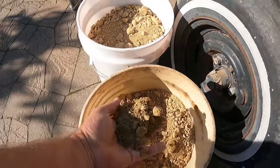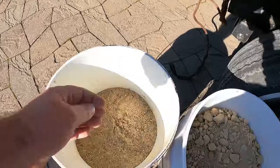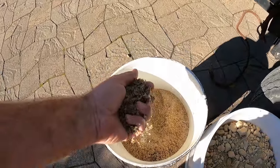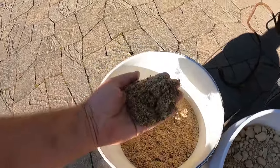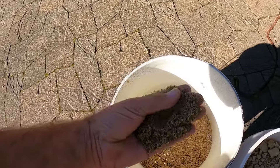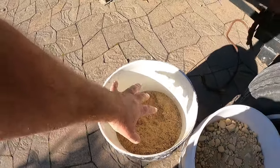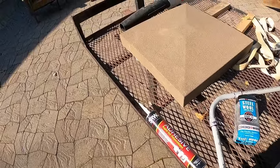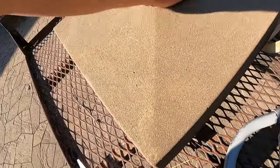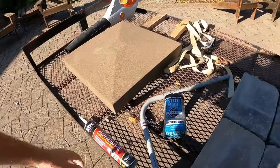In the pails I have some crushed rock — that's going to be our base. We're going to put in about three inches, and I'll be using a little bit of sand — some very simple wash sand. I'll point out that it's a different size of sand, so using mortar sand, masonry sand, or playground sand is not advisable. We want those different sizes of aggregates in there. For cap units, you can use natural stone, but I'll also be using this poured concrete cap. It has a little bit of a slope to it — a very nice looking cap unit.